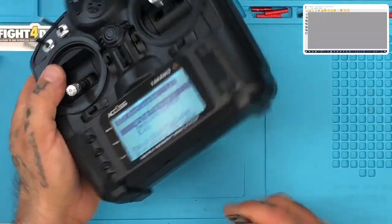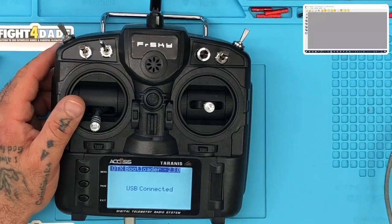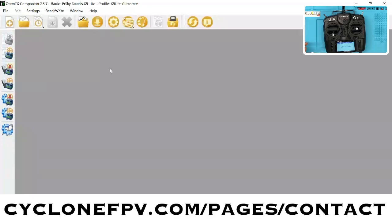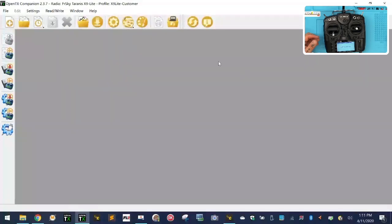From here, I've already done the firmware work for you. Click this SD sync icon and it's going to ask where you want your SD cards to come from. It already knows the SD card folder in your X9 Lite customer, but it says it doesn't see an SD card in your radio. Click the folder option, find where it says New Volume D (we left the name New Volume when we formatted it), click that and then click select folder. Then click Start and watch what happens.